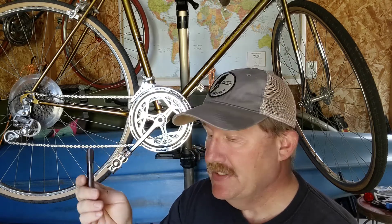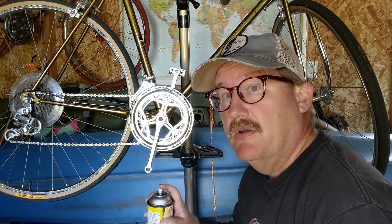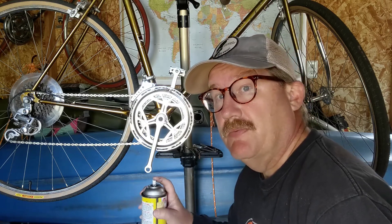These off Amazon are marked, but it's really, really subtle. There's a little Chinese character on the one that's the left-hand one. I was able to figure that out from basically looking at them, and you can see which way the threads are turned. But I went ahead and marked them with a right and a left with my Sharpie so I wouldn't have to think about that in the future. They do recommend that you use a little bit of lubrication for this process, both to help the tap work well and to carry the little flakes of metal, because you are cutting metal out to re-thread it. I'm just using WD-40 type lube.